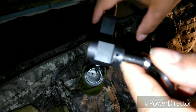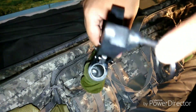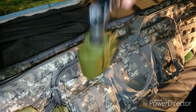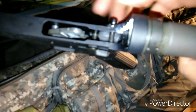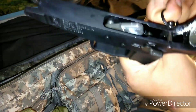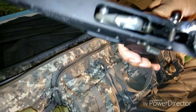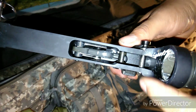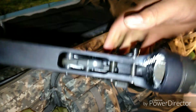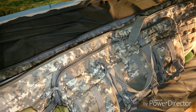After I ground that off, I re-caged the pin, reinstalled the spring, and then the pin, and then this pin. This one on this side was a lot less work required. This one was a lot less work to modify because it only needed that ridge ground down.